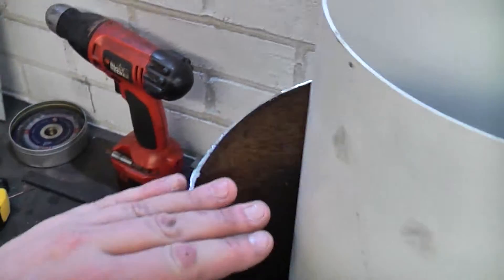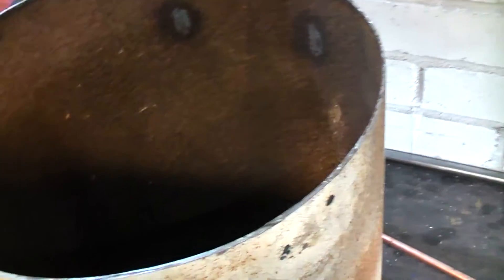When that's in and set, a 200 millimeter insert sits on top of the refractory and will sit snug against that pipe. Then I'll pack the refractory all the way around it and when it sets, pull the insert out — which probably won't come out that easily.